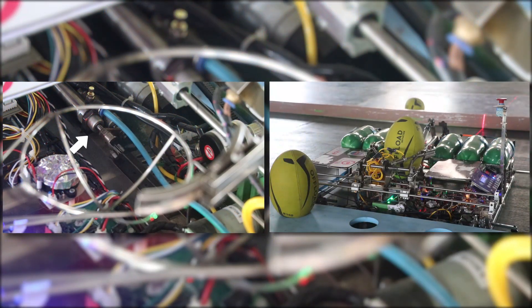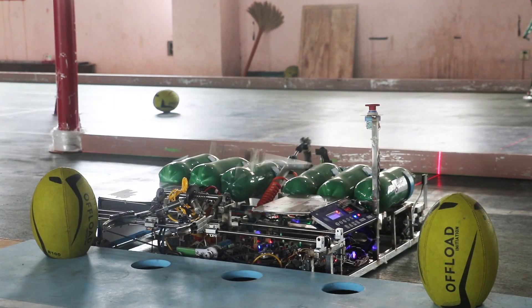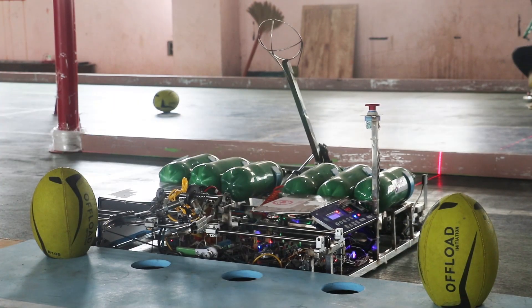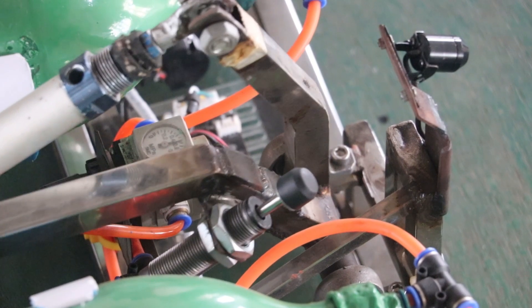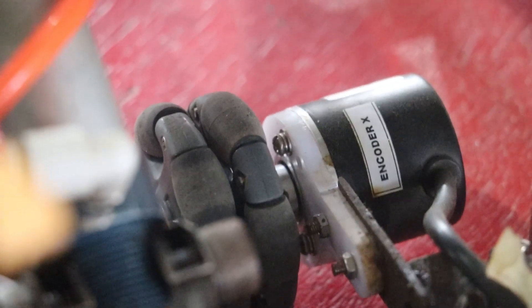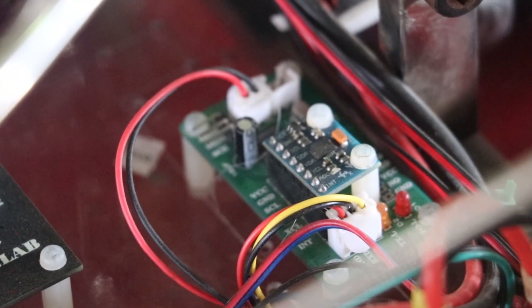The arm can throw the ball forward using a 400-millimeter pneumatic cylinder. There is a pneumatic damper attached to the throwing arm of the passing robot, which helps reduce vibration when throwing the balls. Two rotary encoders are used for positioning the robot, and a gyroscope sensor is used for adjusting the angle and improving performance.